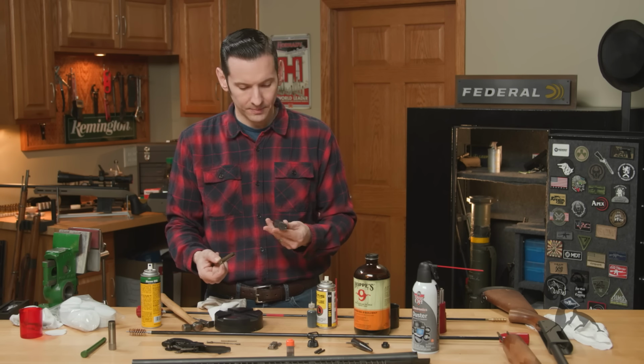Alright. All that's clean. The spring itself, we're just kind of lightly wipe off the outside. I'm not gonna put any lubricant on here. That's what the dry lubricant's for. We'll do that whenever we put it back together. Also inspect that spring, make sure there's no kinks, breaks, whatever. It'll be super obvious.